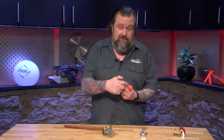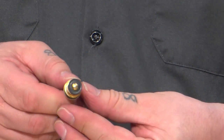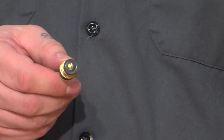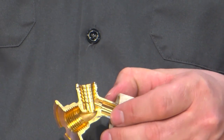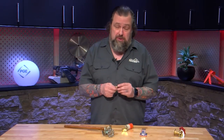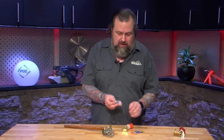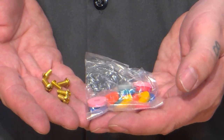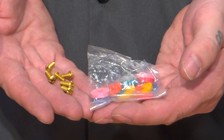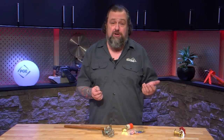If it's not leaking there and it's leaking out the end of the hose, that's an easy one as well, because this comes right out the top and there's a seal at the end. This little rubber washer right here is what stops the water from coming out the hose. There's a seat down here, and over time this turns into dust basically, and now you've got metal on metal and it's rusting. If it's a replaceable one, like most of the older ones are, you can buy a kit for about five bucks at your home improvement store — they've got the correct size washer in it. Take the screw out, being very careful because it's still brass and soft, so use the exact size screwdriver. That will come off, put the new one on, put it back together, and you're good to go.